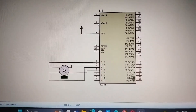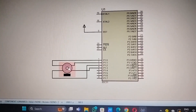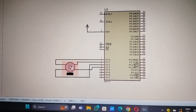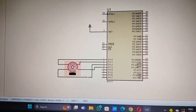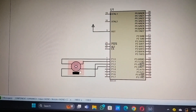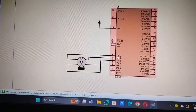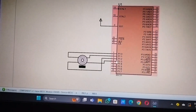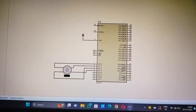This is batch A34 and our project is stepper motor interfacing. A stepper motor is a brushless synchronous motor that divides complete rotation into steps. Each stepper motor has a fixed step angle and rotates at that angle. The circuit uses the 8051 microcontroller, and the stepper motor's four wires are connected to port 1 pins 0 through 3. Clock frequency is set to 11.059 MHz.